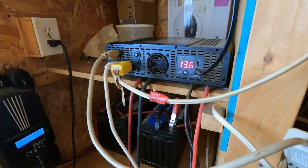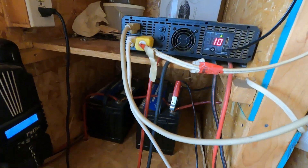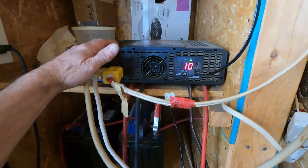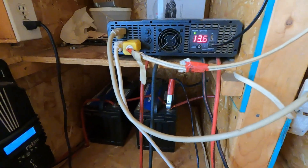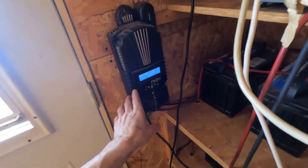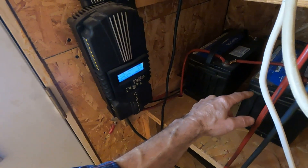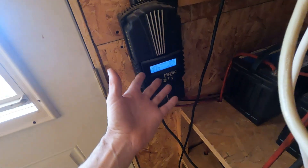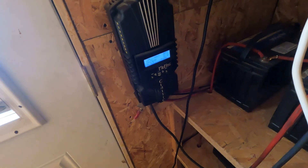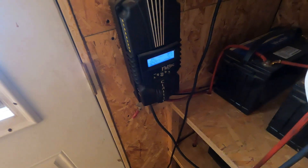I started off with just four batteries and could still use this inverter. But with 24 volt panels, you have to have a charge controller set to step it down to 12 volt for whatever system you're hooking up. If you want 24 volt, change the settings. Do your homework, read your pamphlets, and if you're still unsure, ask somebody who knows more about solar power.